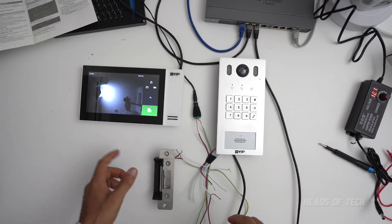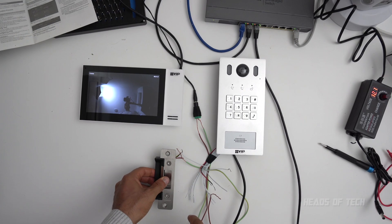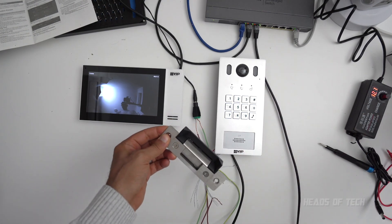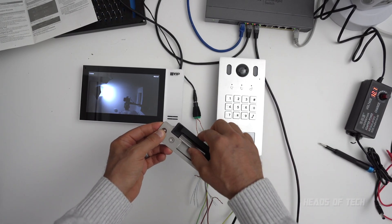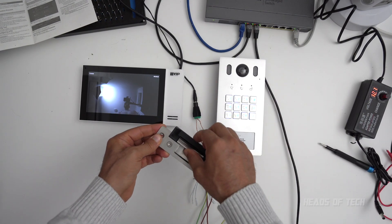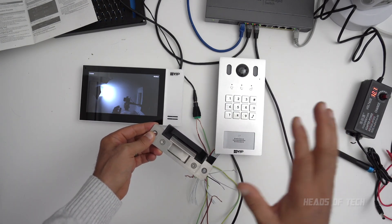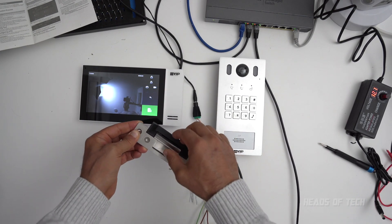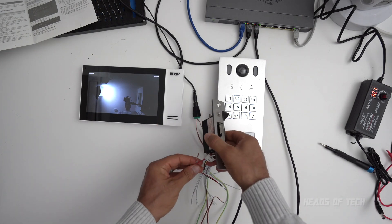The monitor here — you press that button and it supplies power to the lock for five seconds, then boom, it's locked. This is known as an NO lock. There's also NC. This electric strike can actually operate as both. NO means when there is current it's open, and NC means when there is current it's closed. You'd want NC if you want it unlocked when the power is down, and NO if you want it locked by default — so when you supply electricity it will unlock.